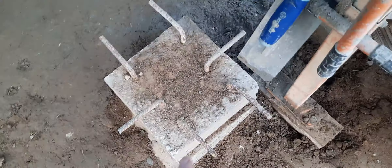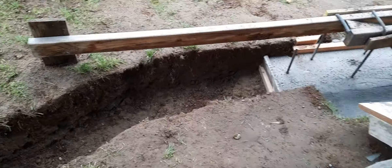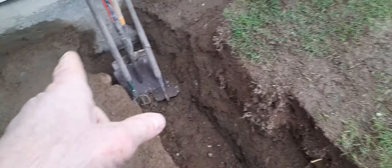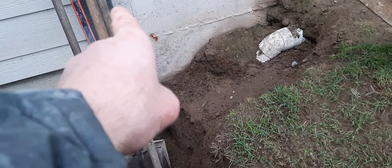There's the rebar. I blocked it off here — basically I'm going to dig that out a little bit today. All these posts go down six or seven feet each, and they're basically just to stabilize the deck when I put it in. This is the curved part, and the curve goes over here.